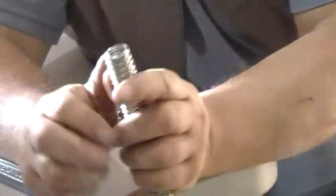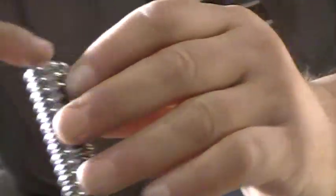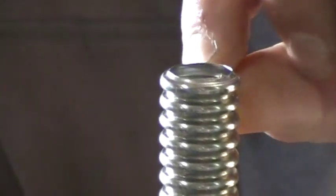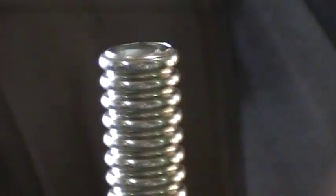Let's see how it looks. That's pretty good. I don't see any major tears. There's a little thing here, but I'll be able to flatten that out. What I'm looking for is I don't want to see a rip down into the next corrugation — then you need to cut again, because that will be a leak.